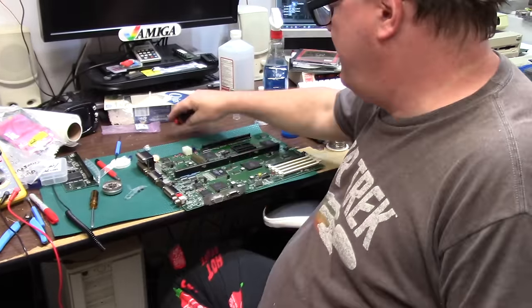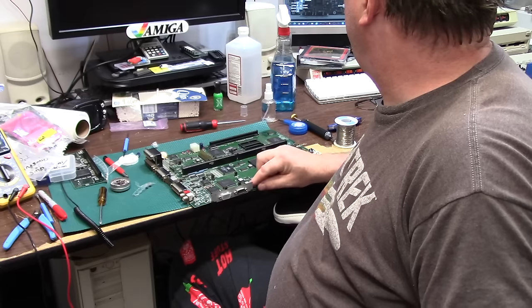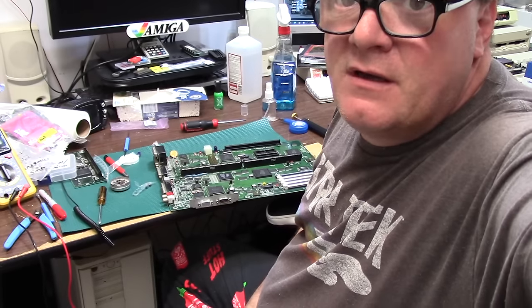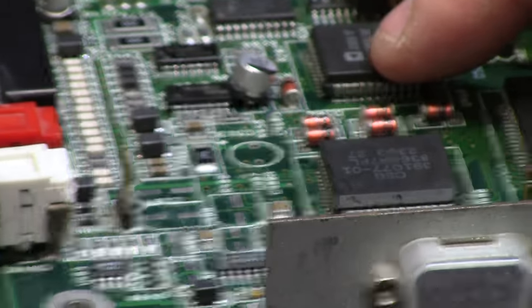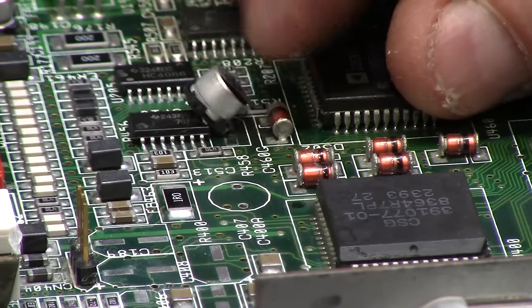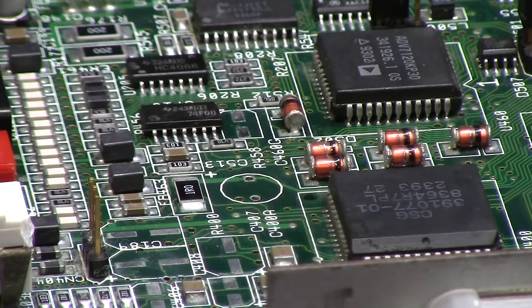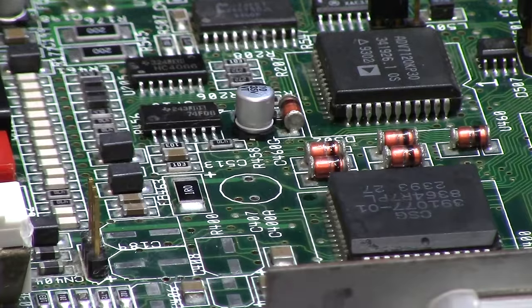I'm reporting an error with the Retro Rewind cap kit. Sorry, Frank, but I gotta let you know. So your C460C is a 10uF 35 volt. And here is your replacement, which is a 1050. But it's supposed to be a 3.3 millimeter cap in there. And this is a 5. And it don't fit. No fit. So, back and bolt. So, should be that size. Big difference. Now it fits next to the chip. Just reporting a boo-boo. So, small cap there, buddy.